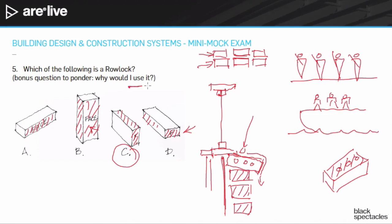So that's the place that I would use it, where I'm getting the benefit of the right side being expressed and exposed. I'm getting the benefit that it becomes an automatic self drip edge element, and will read both to emphasize the sill, but also still as very clearly part of the brick wall. It doesn't have to be used that way. That's just a kind of typical classic way that it would be done. There's a few other ways for other dramatic brick detail you could use it for.